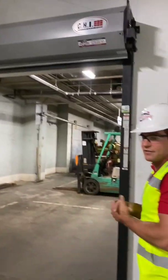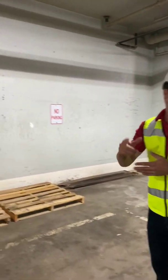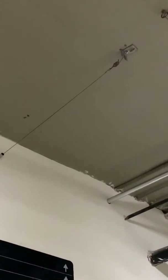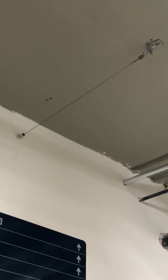We're going to walk over to the other side of the opening to look at the through-wall release, which is more of the same. We've got a cable up there and a fusible link — it's attached. The fusible link is not in the pocket adjacent to the wall and the ceiling. So that looks good on this side, passing our visual as well. The fusible link is not painted and not dust-covered.